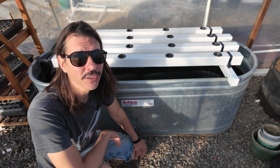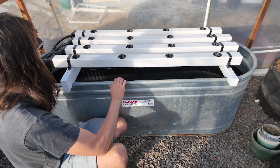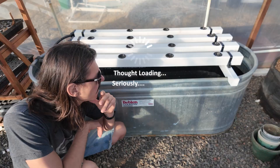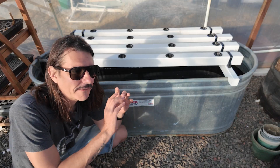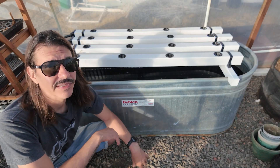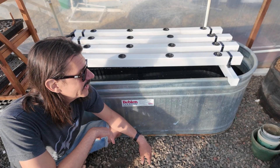So did I revive the greenhouse? I don't think so. Not yet. But we're definitely on a good path, I think. Some clear design shortcomings — I think I need to revise that piece, and instead of putting the barb on the inside of the tube, it should be on the outside. That way I can make the 3D printed piece as chunky and robust as it needs to be. I've got a little bit of work to do there, but otherwise the system works very well and I think this is going to be a successful iteration.